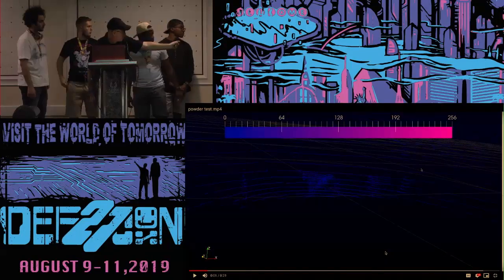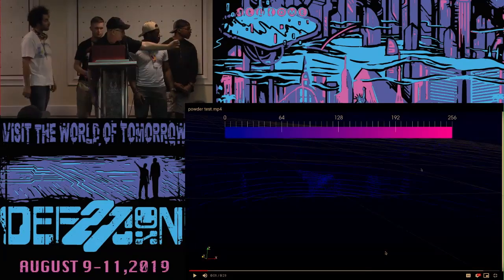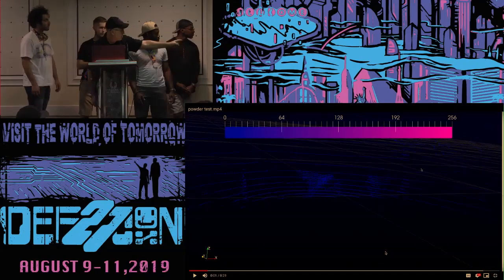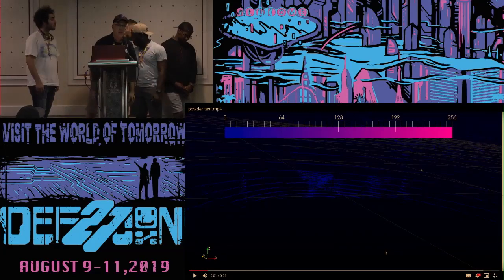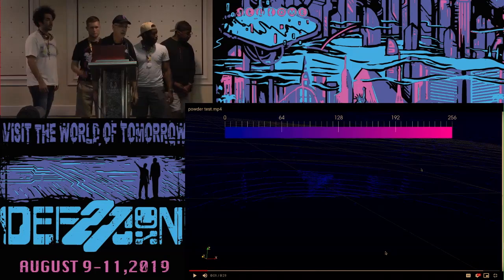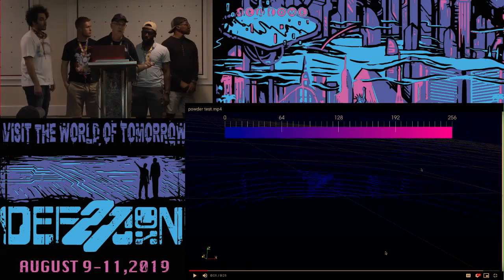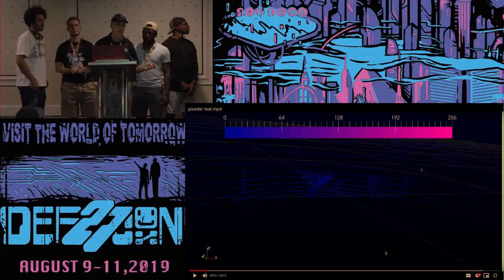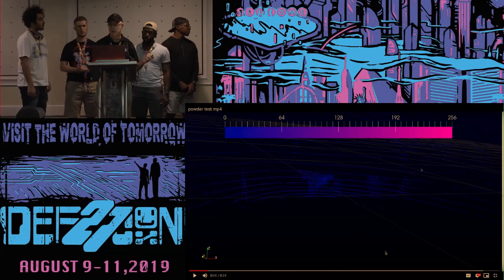On the left and the right you can see two people. On the left is a small vertical shape — that's how LiDAR sees a person. You'll see the two people walking away, and what forms is a wall that lasts about 20 to 30 seconds. That was the very first revision: flour and a couple other compounds suspended in the air. If you make it thick enough, LiDAR interprets it as a wall.